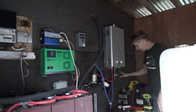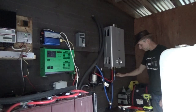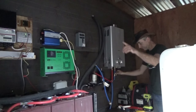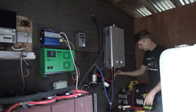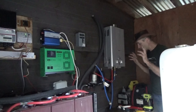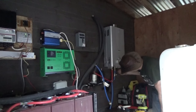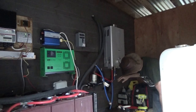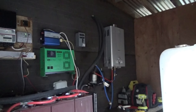Now, I'm going to turn on the pressure to the water heater. Okay. Now the lines are going to fill up. Now the house is pressurized. Hot and cold water in the house are all pressurized. So I've got to make sure there's no leaks around these fittings, or around any of my crimp-on fittings. I've got to go to the house. And when all that's done, then I can connect the propane line and try running hot water.